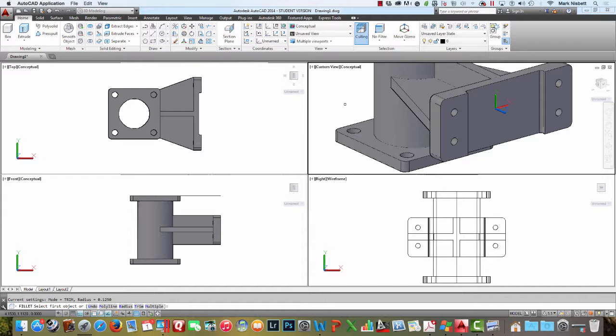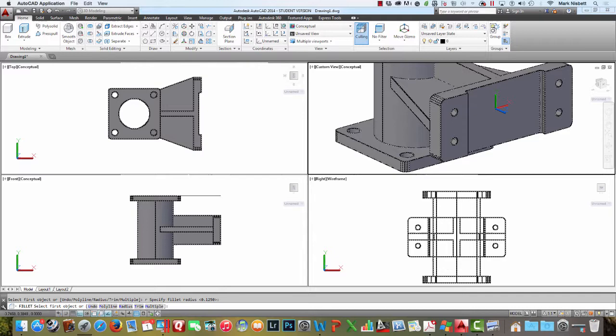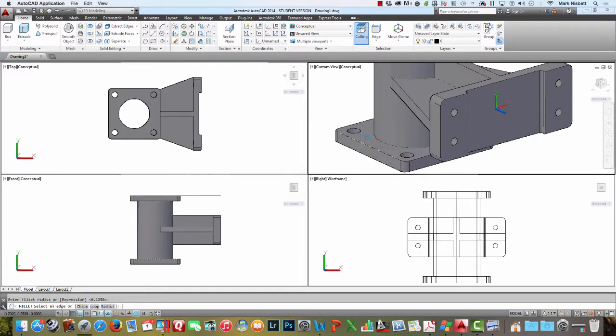Okay. Then we'll do our base plate. So we'll do fillet, and does it say on here? Let's see. I'm gonna say that those are 1/8 of an inch as well. So it says all unmarked radii are 0.06, but I think that's too small for those. So we're gonna use 1/8 of an inch. So I'll go ahead and just pick this line right here, and we'll say loop, the second one, and because we have that, we want to say next so that it's going all the way around the base, and that fillets all that down. That looks about right. And then we'll fillet this other right here where it's welded to the base here, so 0.125 as well. So we have something like that.